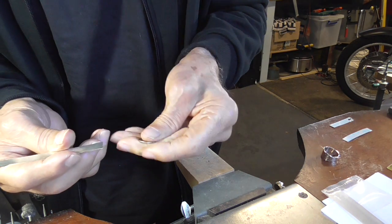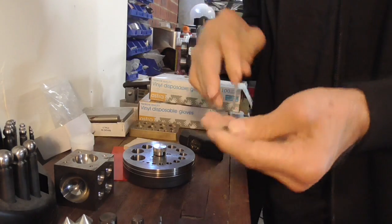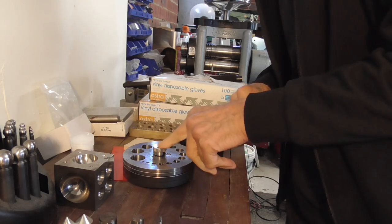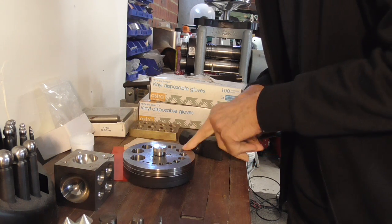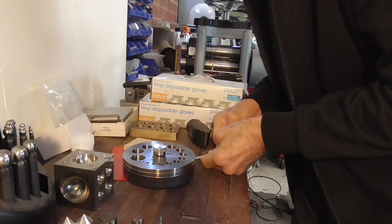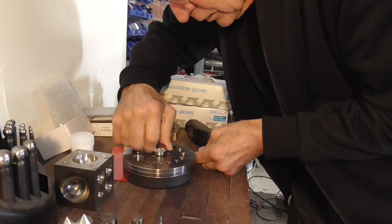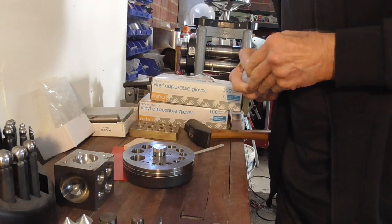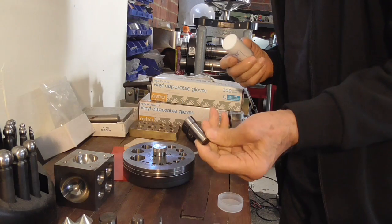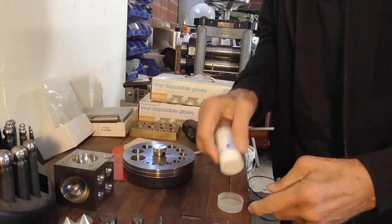To make the end of the metal fit, I'm going to use my disc cutter. This little coin is 16 millimeters in diameter. This is an American hole punch, and 5 eighths of an inch is really close to 16 millimeters. So I'll slip my metal in there and use some lubricant. Make sure that your punch fits the hole correctly and run a little line of lube on your cutter — you don't have to, but it makes it last a little bit longer.